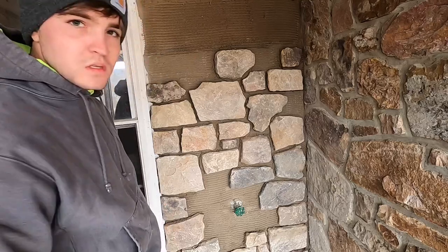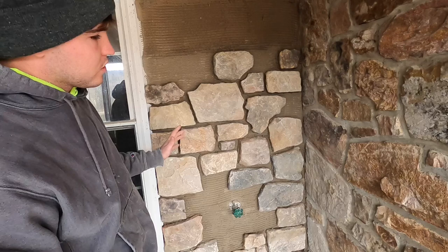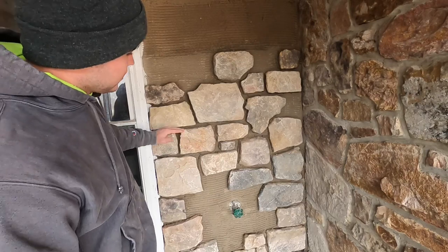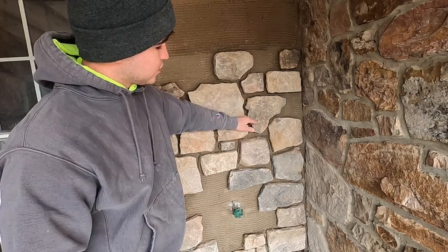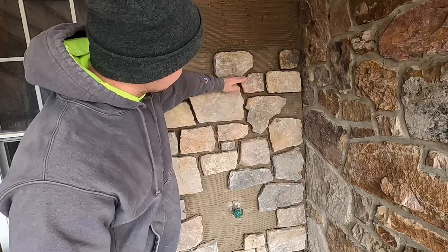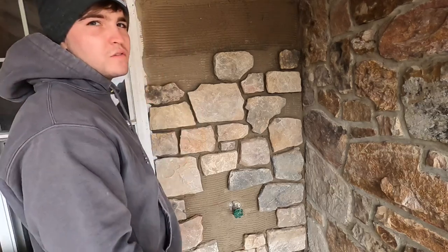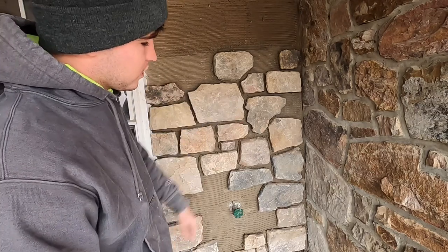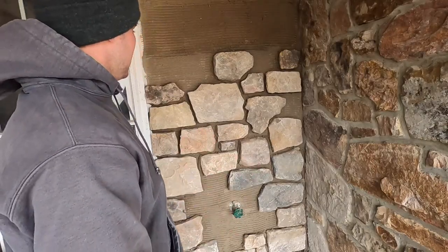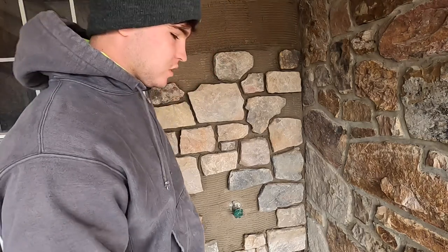Another thing: it's not like a block wall or a brick wall where everything is completely staggered bond. I'll go like three stones and then I break it up — two stones, three stones, break it up. Keep to the rule of no more than three stones, maybe four if you have to, but keep it broken up with a consistent variation.